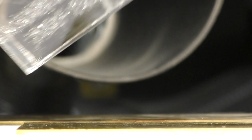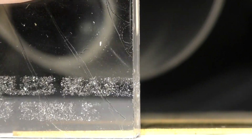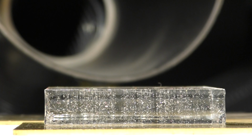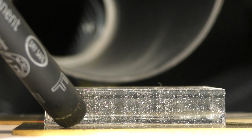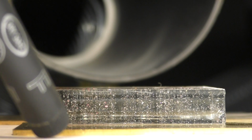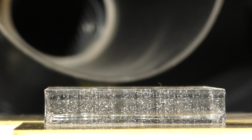But it just doesn't look right. I mean, it's 3D, which makes it interesting, but I would like to see it so it's obvious on the surface, like one of the others that we produced. And we did that by pulling the focus up a little bit. So at the moment it's set to 8mm, which is 3mm to there, and 5mm away from 9.5, which means it's 4.5 into the material.